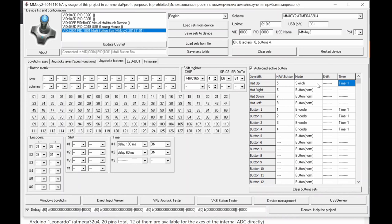If the toggle is already in the on position when you start the application, toggling it off will pulse the on-action in software, because the software doesn't track the physical position. That's the main drawback of the Switch function. 'Switch On' only detects the transition from open to closed (the pressing direction), creating a pulse with a configurable timer (e.g., 100ms from Timer 1).